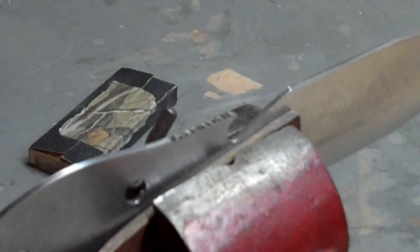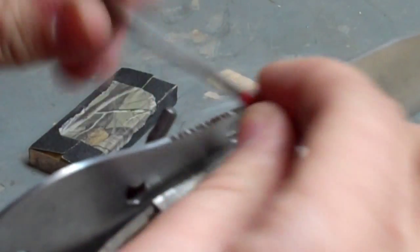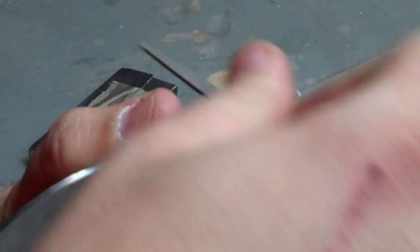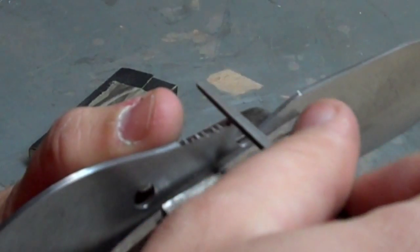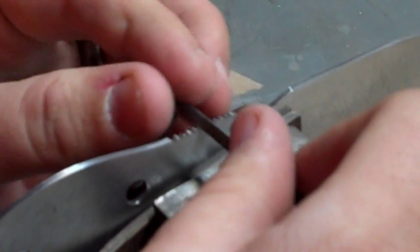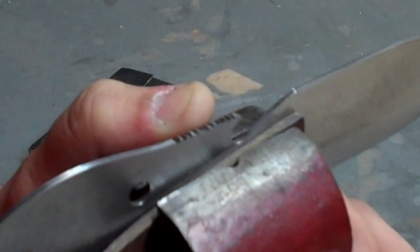After that, I decided to add a little bit of texture to the back of the handle area, right behind the bottle opener. I scribed lines 50 thousandths apart, and then started cutting in with a triangular diamond file to make kind of a grip — a thumb rest. It worked pretty well once the depths were all even. It came out looking very nice, relatively coarse.